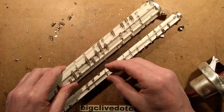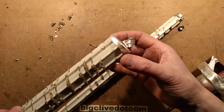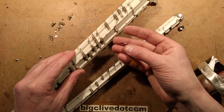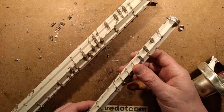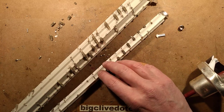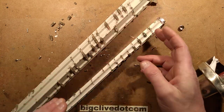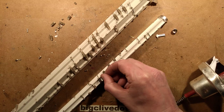The most interesting bit is that the fuse wire is a ribbon wound round the outside of the core. It's not just one wire — it looks like three co-wound together in a helix spiral. That spreads the current load and presumably lets them use one standard metal ribbon for different current ratings by multiplying the number of strands. I'm also wondering if the inner middle core is actually part of the auxiliary system designed to blow and release the pin — which is possible.